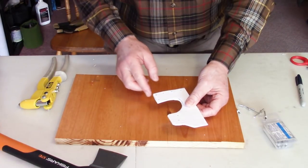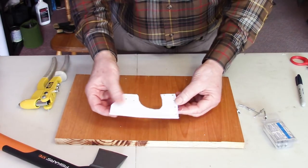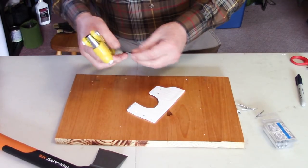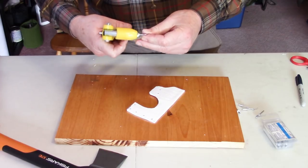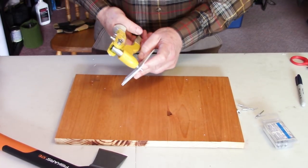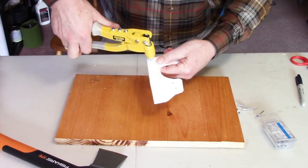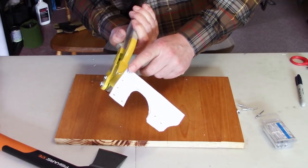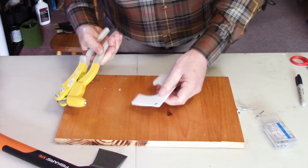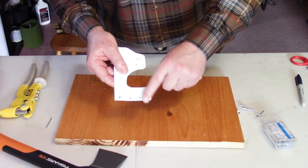I've got all my pilot holes drilled. In full disclosure, after laying the hatchet on top of the mask, I realized the beard — the end of the mask — was a little longer than needed, and so were the two ears that come down the side toward the axe shaft. So I cut both of those off approximately a little over a quarter inch to almost a half inch, just to make it a little shorter and more likely to fit the axe better in the final product. Next step is to put the pop rivets in. I'll show putting one pop rivet in — I like to rotate the pop rivet tool around a little circle so the mushrooming on the back side makes a slightly more spherical mushroom. I'll do the rest off camera.